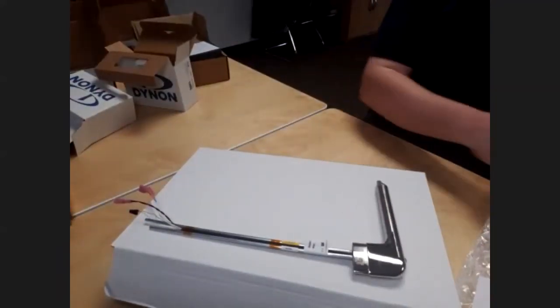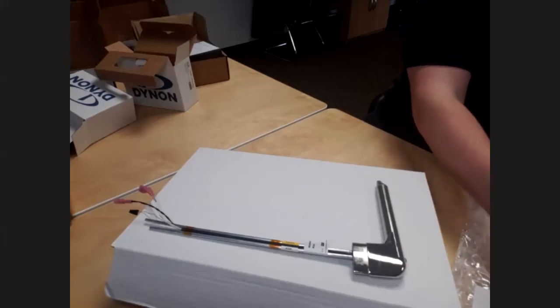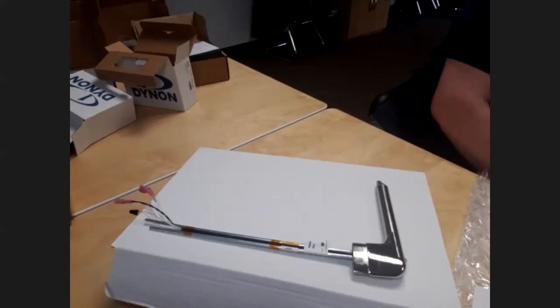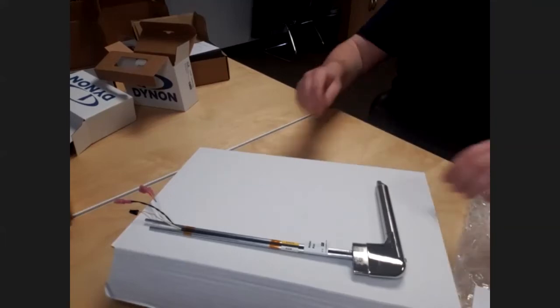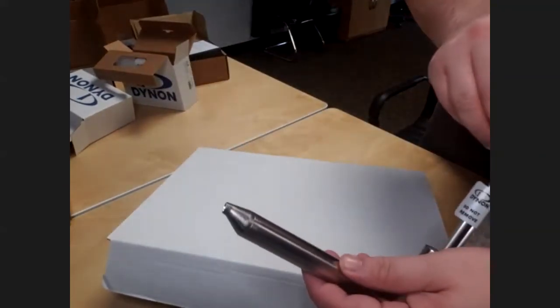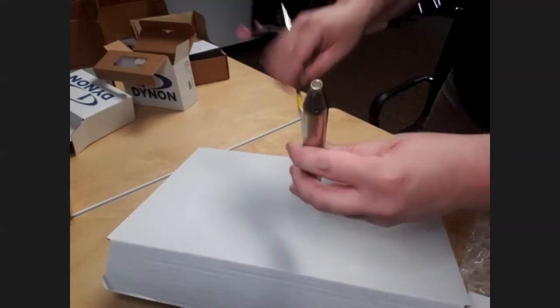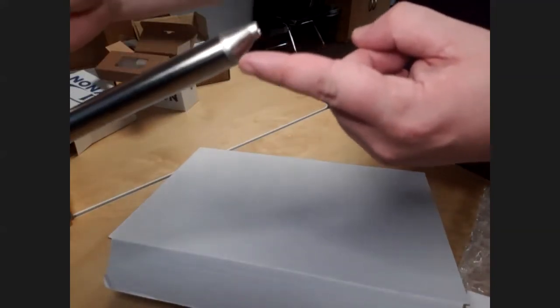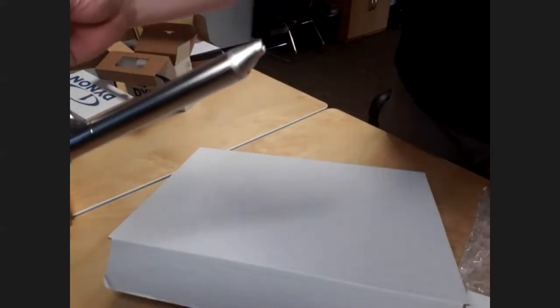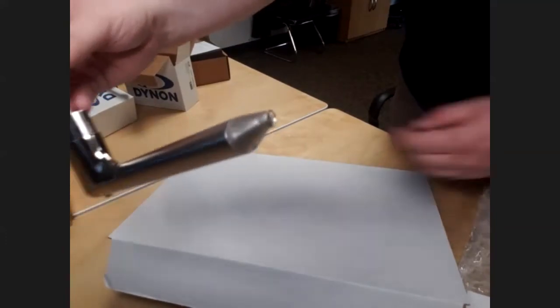It was designed to be very sensitive to angle of attack and very insensitive to airspeed. When you look at the snout, it's got a very specific contoured shape that's also resistant to the airflow changes that happen when you're yawing. Fundamentally, it's a differential pressure device. When you're flying straight and level, the pitot port is the straight-on port, and the one on the beveled edge on the underside is getting the air at a lower pressure. But as you incline into the airflow, when your angle of attack is increasing, you're seeing more air come into that port. And so that's how we're sensing angle of attack.